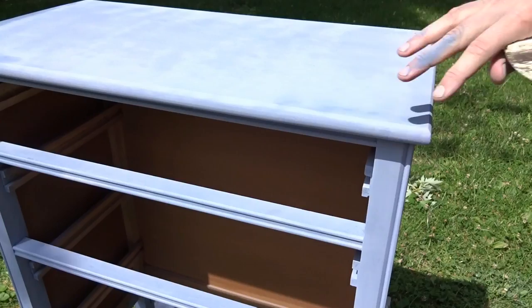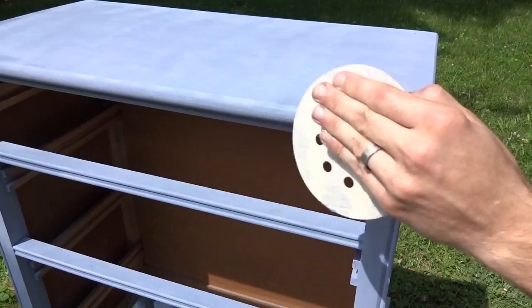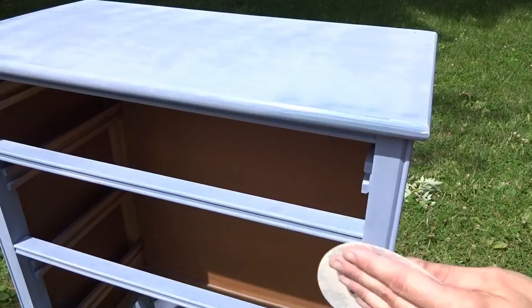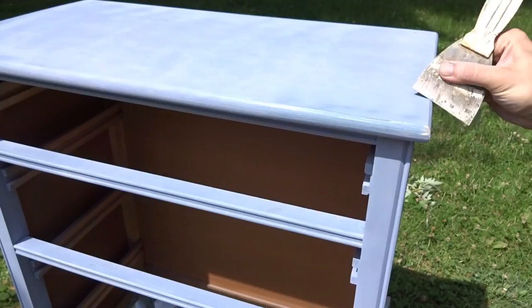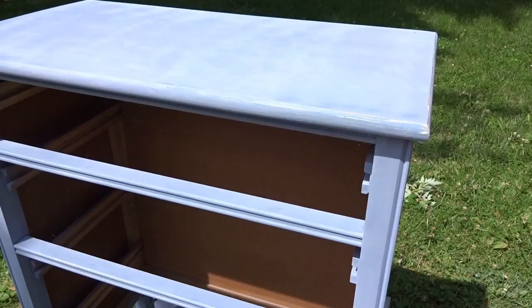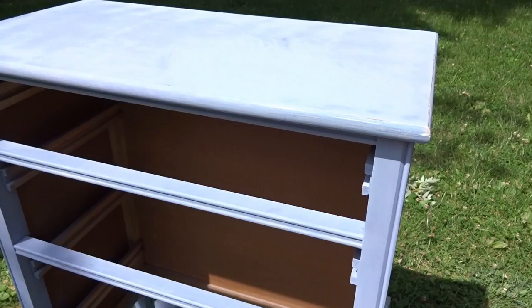On this side I'll go ahead and use some 220 sandpaper — yeah, that's pulling the paint off a lot easier. And another thing you could do is take a scraper — it would be pretty harsh but it will definitely pull paint off. I don't think I'm going to go crazy with the distressing, just the corners, real light. I want it mostly solid color but I'll go through it to make it look a little bit aged, and then I have to coat it. They gave me a wax in a spray can — pretty cool — so I'll try that.